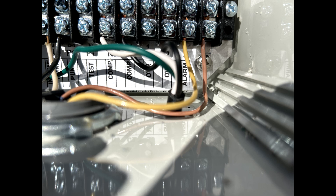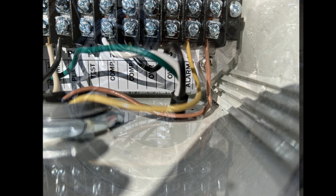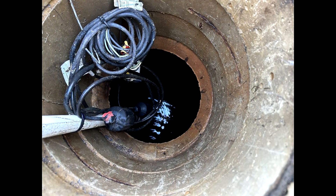At this time, it's a good idea to verify the alarm wiring colors coming out of the control panel to make it easier to identify in the tank. As I stated, this was originally a Hoot system and Hoot had the habit of having their wiring come from inside the tank and coming up under the risers. This is why the wiring is spliced inside the tank — a habit I am strongly against if there is a junction box available, but there isn't on this system.